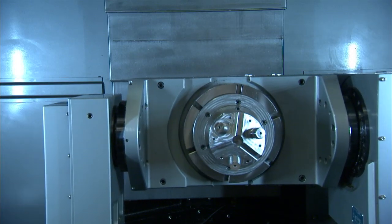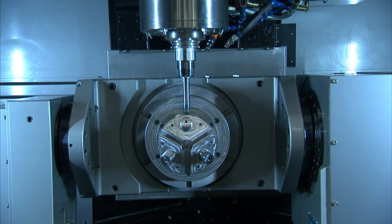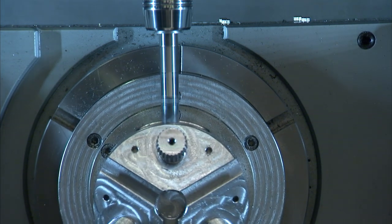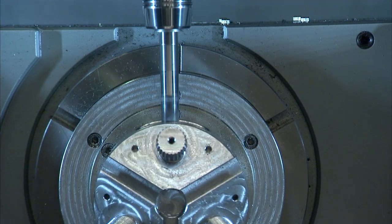As I see the machine move here, can you achieve negative angles? Yes you can — it's minus 30 degrees in the A-axis through to plus 110 degrees, and then full rotation on the C-axis. That gives a lot more versatility, because some 5-axis machines can't achieve a negative angle. Yes — you can get in very close and right up behind the part.